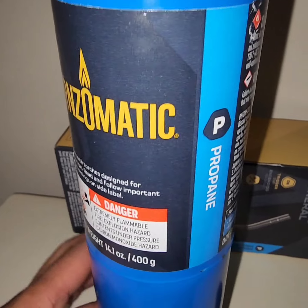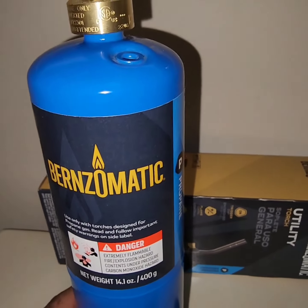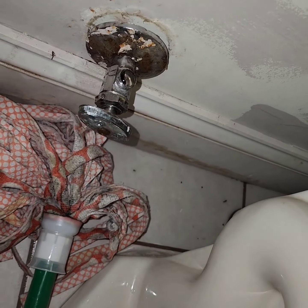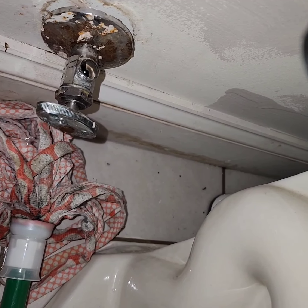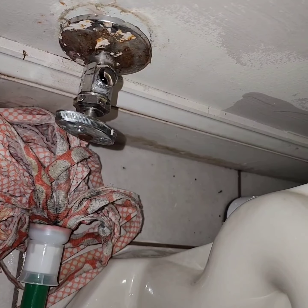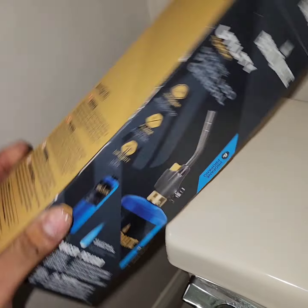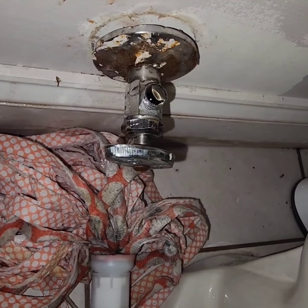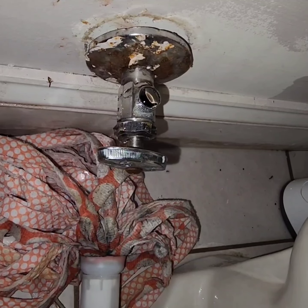What I found out is this is copper and I don't have a lot of space to cut it. When I was at Home Depot I purchased this torch — I think it was about $25 — I'm going to heat it up and remove the old fitting. Once it's out I'll be able to install the new one. Unfortunately I won't be able to show you that part because it involves fire and I'm not trying to burn my house. This house is a little older so I'm not sure why the pipe is so short, but it is what it is.